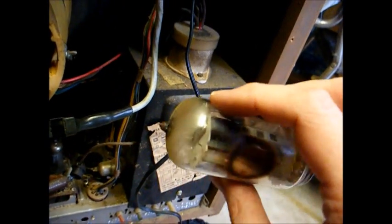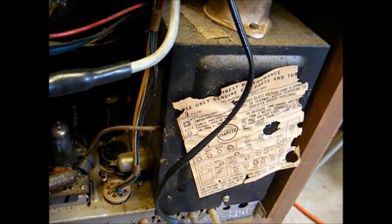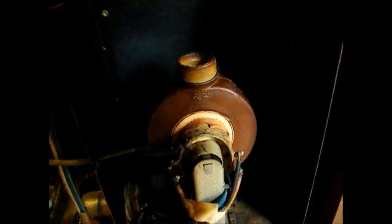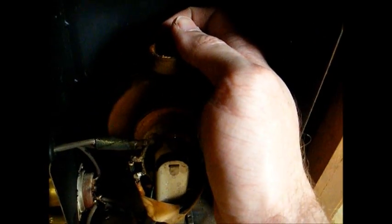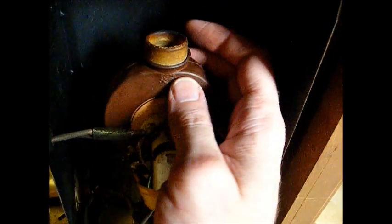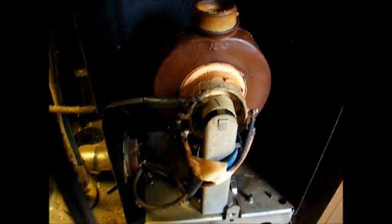Also take note that the original tube cap on the horizontal output tube was busted off and is nowhere to be found inside the set. While we're waiting on the CRT to cook, let's have a look at the flyback transformer. There's the flyback transformer — there is some wax drippage down in the bottom, which may or may not be a sign of trouble, and I can feel the back side of the core has a big hole in it, so that could be a sign of trouble. Yeah, look at this crusty mess where it burned. This set may need a new flyback transformer, but we'll know more about that once we power it up.